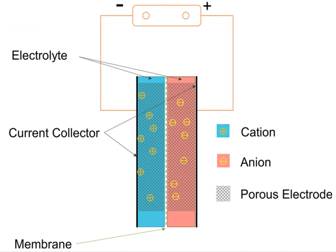In the process, there is no transfer of charge between electrode and electrolyte, so the forces that cause the adhesion are not chemical bonds but physical forces, e.g. electrostatic forces. The adsorbed molecules are polarized but, due to the lack of transfer of charge between electrolyte and electrode, suffered no chemical changes. The amount of charge in the electrode is matched by the magnitude of counter-charges in outer Helmholtz plane (OHP). This double-layer phenomena stores electrical charges as in a conventional capacitor. The double-layer charge forms a static electric field in the molecular layer of the solvent molecules in the IHP that corresponds to the strength of the applied voltage.